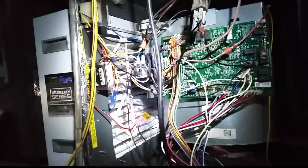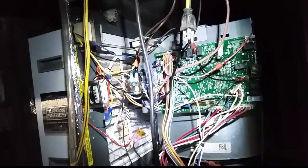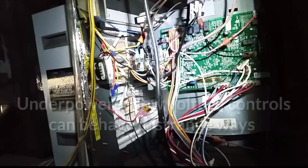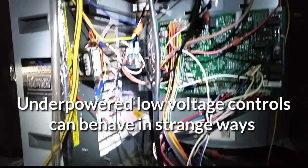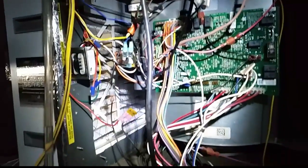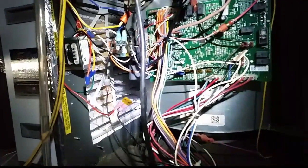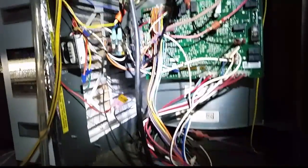I'm in the crawlspace now. I just changed out the four-inch TechPure filter — there's our old one over there, all dirty. We're adding a new transformer for the new zone board. It probably doesn't require it — last time I didn't add one — but we're going to do it just because we're going to pull out all the stops this time to make sure that there's no control left unpowered or not wired correctly.